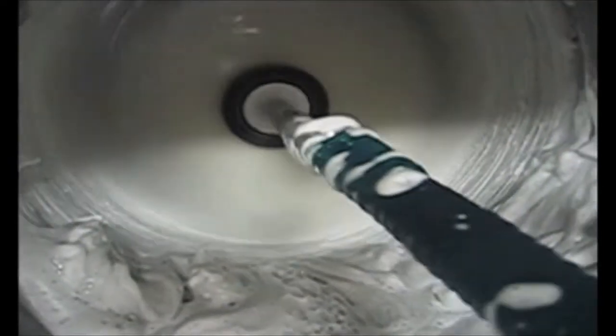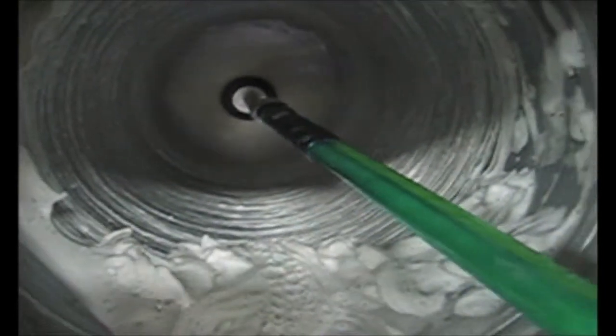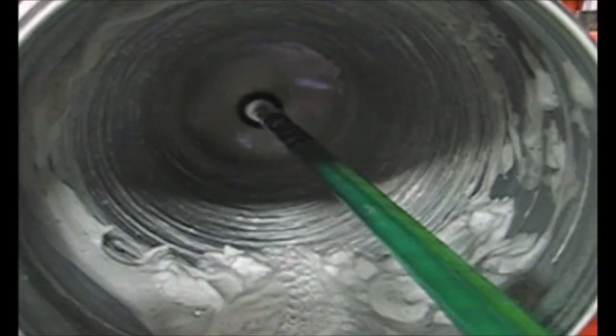Always start first with a foaming type of alkaline degreaser, as this affects also the sides and top of the duct. Typically, this needs a reaction time of 1 to 4 hours, depending on the chemical and the conditions in the kitchen or duct. In case the grease layer is deep, you may need to resort to so-called power washing, i.e. brushing at the same time as spreading the chemical in order to reach to the bare metal surface.